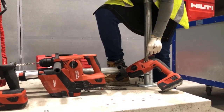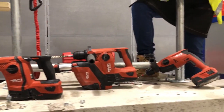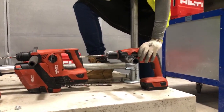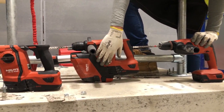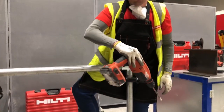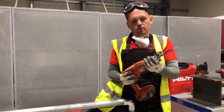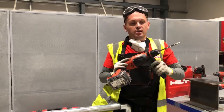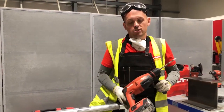There's a bit of a difference in the style of the tools. The TE2 is a pistol-style tool, designed to hold on the back with a side handle. If you're doing 6mm holes, some plugging — maybe you're an electrician or work in the mechanical trade, drilling into masonry a few times a day at 6mm or 8mm — the TE2 is a great compact rotary hammer for you. You'll notice as well, all on 22V.